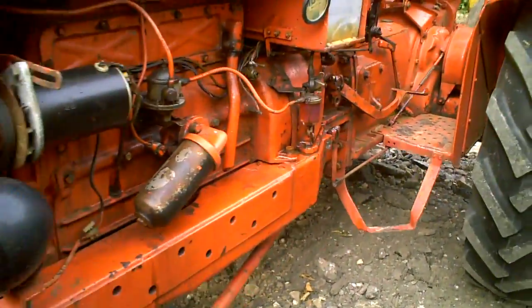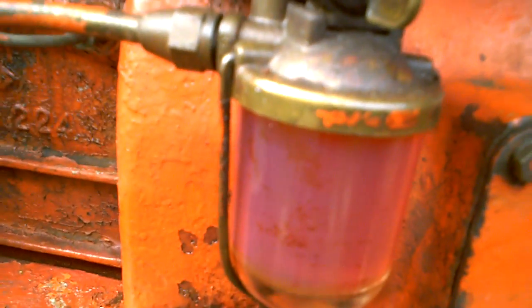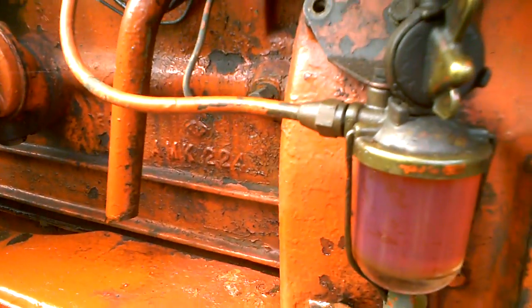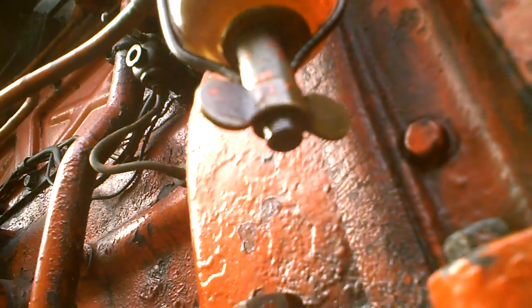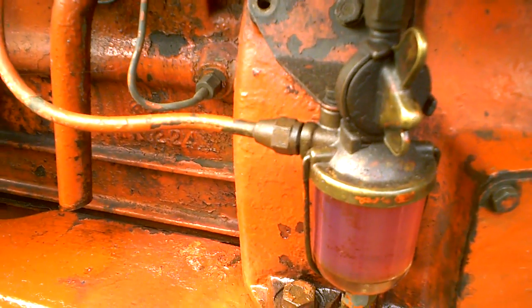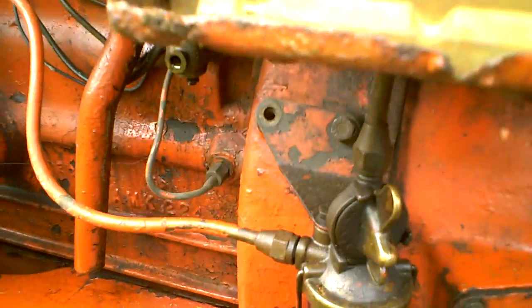And this is important, I knew there was something else. I cleaned the filter out. It was full of crap. No glass filter. We've not got a diesel filter yet for it, but I cleaned that out. And these bodges, they're not nice to have to deal with, but somebody has put a new 2p on that underneath to hold it on. When I cleaned that out, it was absolutely full of seeds and rubbish, so that's all nice and clean. And it certainly works alright. When I pumped it, the diesel floods out, so there's no blockage or anything like that. So that should be okay.